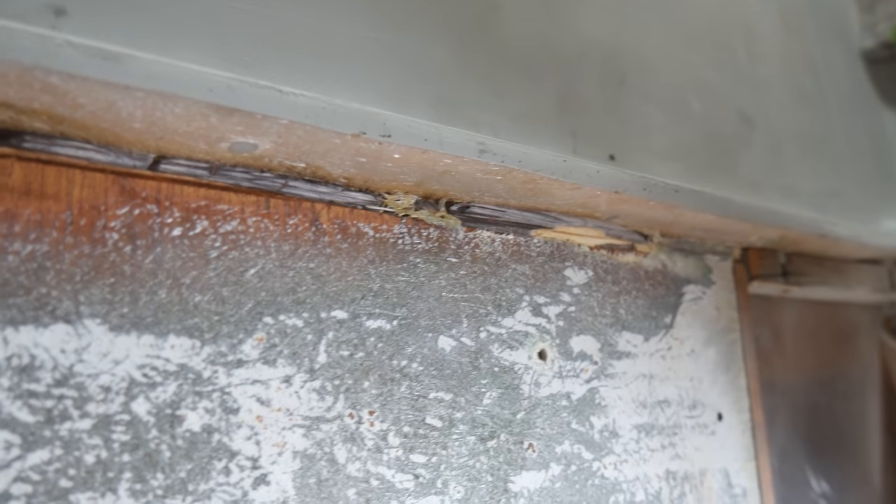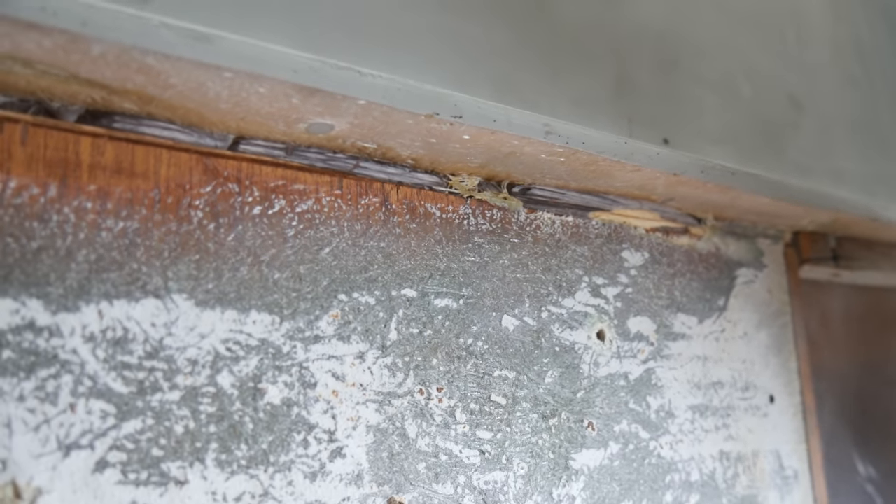There was also this other little fix - a lip where the cockpit floor screws in - and there's been some delamination here, so I've cut all of that back. I need to put some filler there and then some epoxy tabbing around it. Now to fill up that through hole I'm going to go the other way around - the largest piece is the first piece you put down and then you work back to the smallest piece - and I'm going to put that on the peel ply and just put the whole piece on.